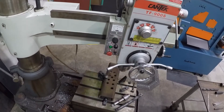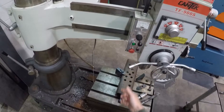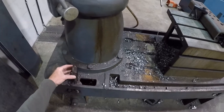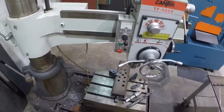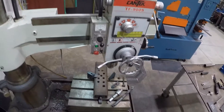Other features include the light and the coolant. You can see the coolant come out here. The coolant is filled through this tray here, and we just fill it with the same coolant used for the bandsaw — just water-soluble oil. You have to manually turn that on and off as you drill.